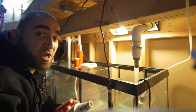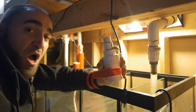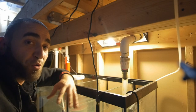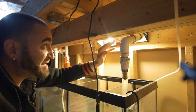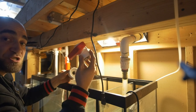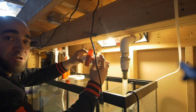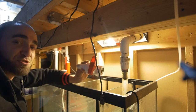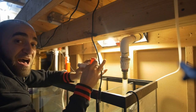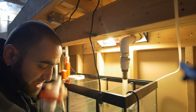On the right hand side for the return pump, I'll install a three-quarter inch coupling and then this union ball valve right here, which is going to allow me to control the flow of water from my return pump. I also have a valve for the left hand side, so I'll be able to control the flow of both return pumps via both union ball valves. Having these union ball valves means I can simply unscrew them, take the pump apart, service it, replace it, clean it out, and then connect it back. I highly suggest union ball valves for plumbing - if a valve isn't needed, you can use a union alone, which is just two pieces that screw together and allow convenient disassembly.